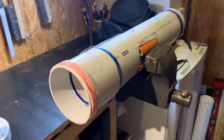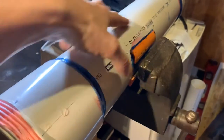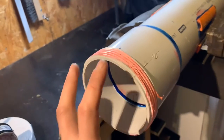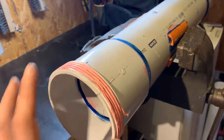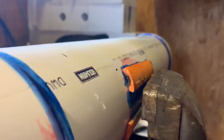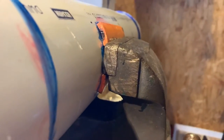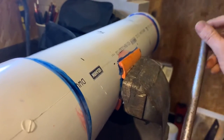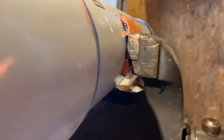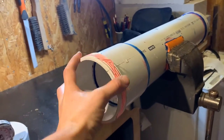So what I've got basically — I put the tube in the vise and I've glued on these other bits of PVC from a different pipe, so that I've got a place for the vise to latch onto. Because I've really got to crank the lid onto this thing really tightly so that it's almost entirely airtight, and obviously it's a cylinder so it rotates. When you're doing this, you really don't want to crank it up too much because otherwise you get the PVC deforming. I just slightly do it and then I've got this bit latching on underneath and that bit latching on there — now that's as solid as a rock and I can crank the lid on as tight as I want.